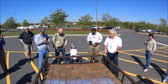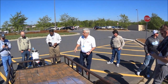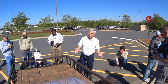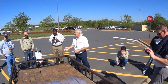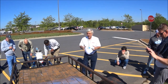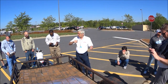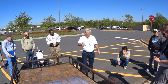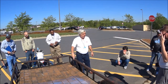If I got a paver, in Florida, they build pavers, we lose 85% of the sealer inside the paver. I mean, they're so porous. So that's going to require multiple coats. And then, of course, we seal those pavers in different conditions. Hot days, 2 o'clock in the afternoon, mist coats, where the sealer is hitting the substrate and flashing. We're starting to build up the coating, the solids, to develop this.